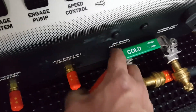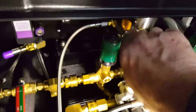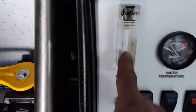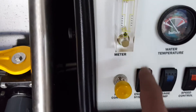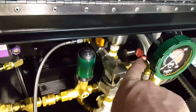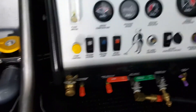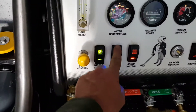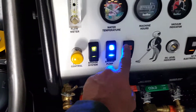We're going to get it going at high speed with all three switches — engage the pump, the cat pump engaged — and go to high speed. Then we're going to crack this open halfway, as well as open the bleeder valve completely. Watch the sequence: as it starts burping and bubbles come out, we'll eventually open this up all the way, then shut that off. Just follow along — hopefully you can see even if you can't hear.